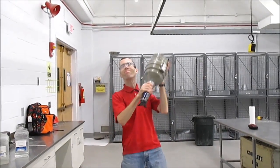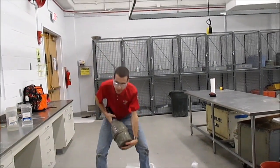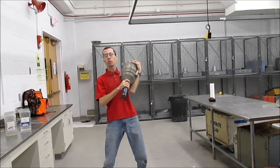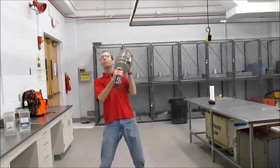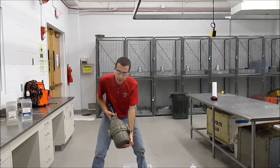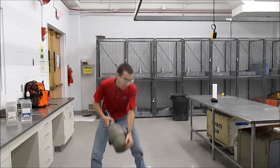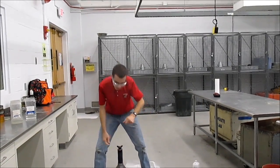There are a few ways you can do this. I prefer to disturb the concrete from the base of the meter. If this is a little too rough, you can take it up to your shoulder and rock it. The idea is to keep it upside down no more than five seconds at a time. You will start to hear the aggregate shaking around in the meter. That's 45 seconds.